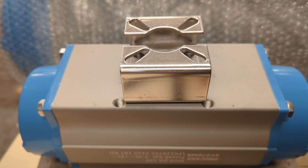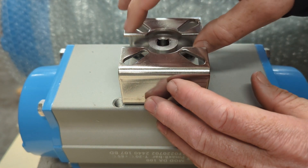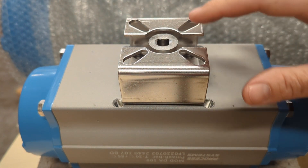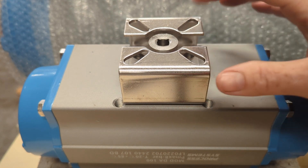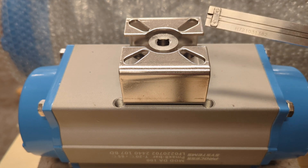We get these folded out of stainless steel — they're very strong and will take the torque of the mounting interface. You couple them with what we call a drive dog. We make the drive dog to the height of the bracket, so you've got a direct mount option straight off the shelf, no custom machining required. We use these commonly where you don't get a matching mounting interface between the valve and the actuator — pneumatic, electric, hydraulic, it doesn't matter. If they don't match up, this is a great way to bridge the gap.